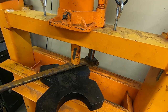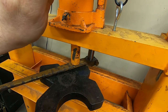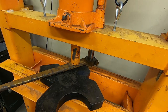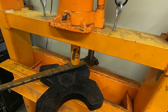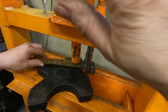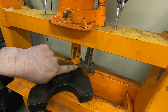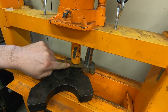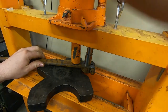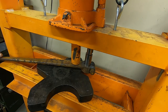Just watching everything carefully here — I'm looking from the side, kind of down this way. I can see my shaft that I have for support is getting close to contacting the framework back here. So I think we're going to have to slack off and reposition. Alright, try number two. I've relocated — moving up closer to the split bore end here, because when I sighted down, we pretty much got rid of the bend that was right here, but we still have some right there. Let's just see what happens with this. It's going to get more difficult to bend up here because it's so much fatter.